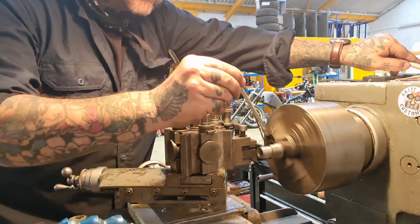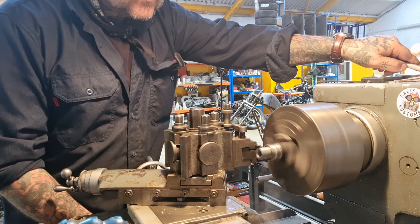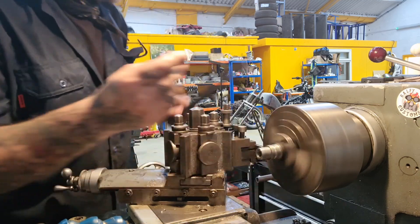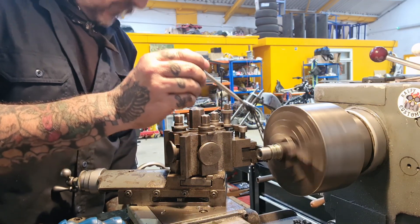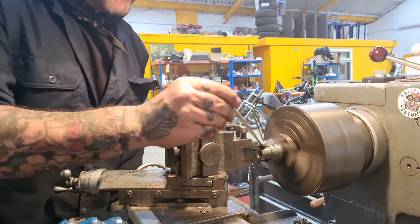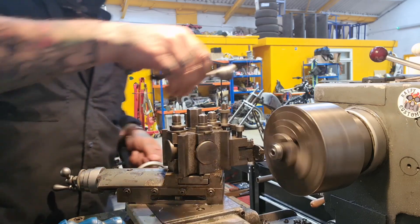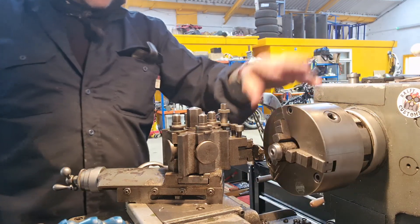And now I can rattle off three or four or five or six and they'll all be the same size. And finally we set up to part these off. I'm guessing this could be the last job for this tip - it's a parting off tool tip. If you follow me regularly you'll know that every time I use it I'm like 'it's about to fuck this tip.' I'm expecting it to die on me on this job because this steel is not soft stuff. But we'll see. Any bit of oil - like a bit of lube - that's what separates us from the animals. That will pop off any minute now. The steel is still fucking going strong - there you go. I'll make a few more of those, another one for the job and a couple for stock while we're at it.